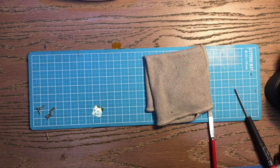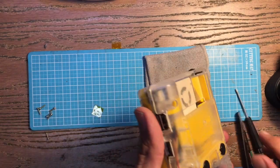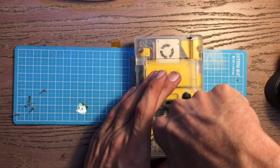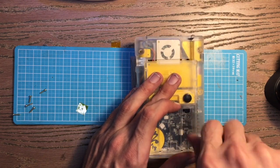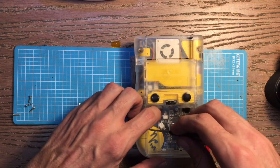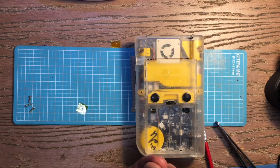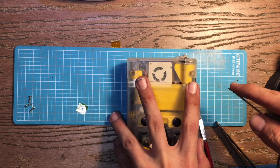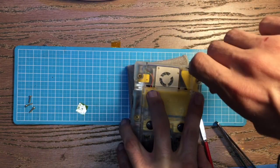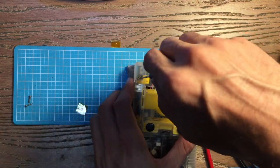Now close it up, paying attention to the cable routing up and around the vent fan. Looks okay — make sure there's no wire interference as you close it up. Everything should button up nice and easy. Six screws in the back, connect your battery and you're back in business. Note: this case version has very small holes that don't accommodate the screws well, so I dropped some washers in there to give it extra help — seems to work okay.